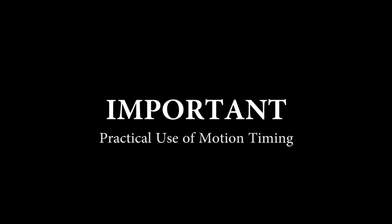Motion timing of the TPAS-3 and SC500LW is factory configured and cannot be changed in the field. It is important to consider motion timing and its practical use in your application. Any changes in motion timing will require the unit to be returned to the factory and will require a fee to reprogram. The most common motion time settings are 90 or 120 seconds. The potential for false alarms will increase when using shorter motion time settings.